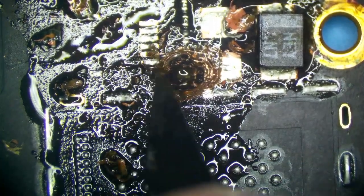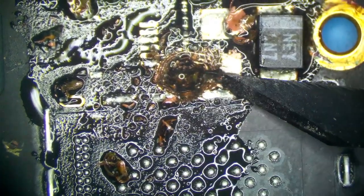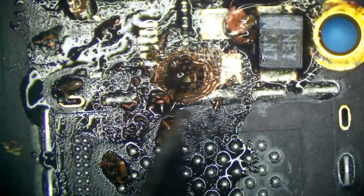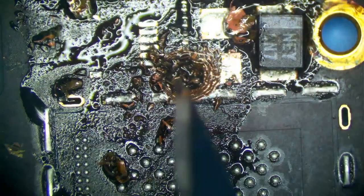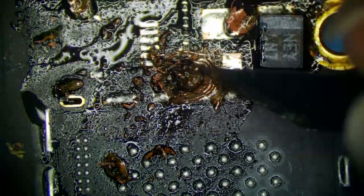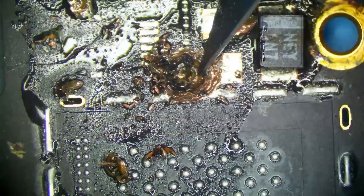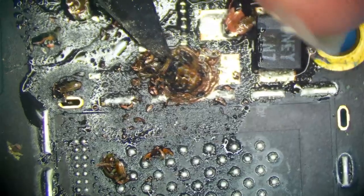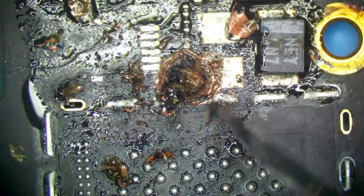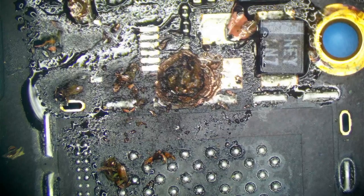The reason why I'm cutting lengthwise is I want to see each layer so none are shorted together. I want to have a big enough gap between them. I think that's where that short was right there. I think I got it. Clean up around this side now. Flush.